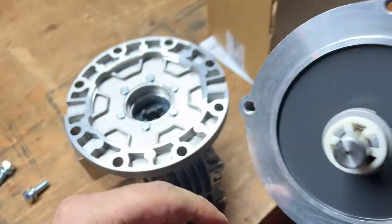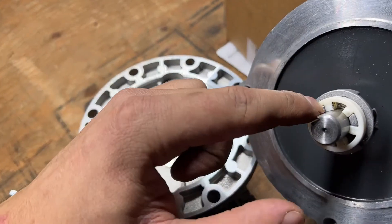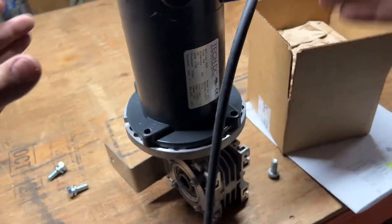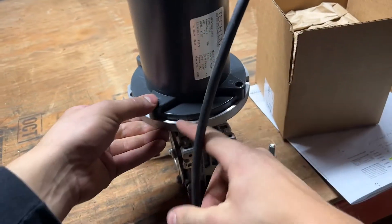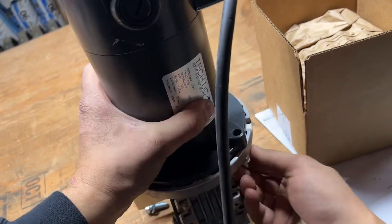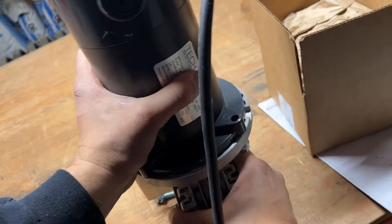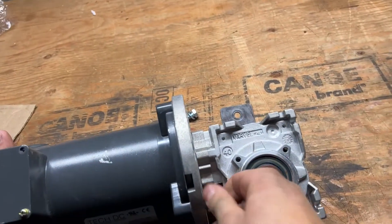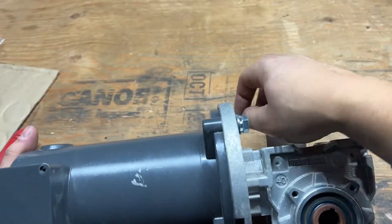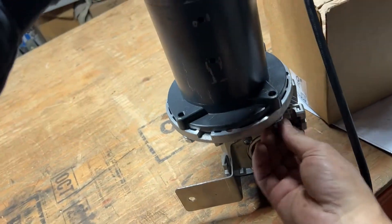When you separate this, you can see it has a coupling — this is why we don't really want to lift it up. Right in here it's got mates, so we just need to make sure these prongs sit in these holes. It just takes a second; it falls down on itself, there's no gap, so you can see it's in position. Thread the bolts in — no gap right there means the coupling is engaged. Just snug those up.